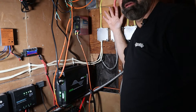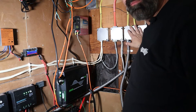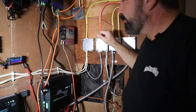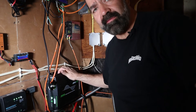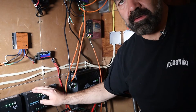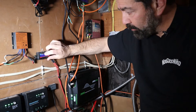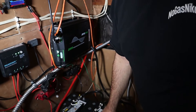This used to be where my breaker box and fuse panel were, but they moved it outside due to code when I had it upgraded. That's why all these electrical boxes are here — electricians had to put jumper wires. I've got nine of these boxes jumping over into the main panel. What I have here is a 2,000-watt pure sine wave inverter from Harbor Freight, two Renogy charge controllers — one for my 100-watt solar bank and one for my 60-watt panels — a wind controller for my windmill, and a meter that reads watt-hours and peak amps.